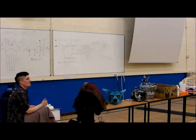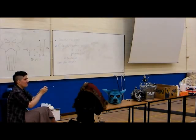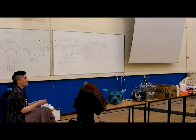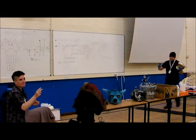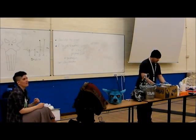The other kind of cure is snap cure. What will happen there is it will be clear, and it will be runny, and then suddenly you will see a white spot and it will spread in about 10 seconds to cover the entire mould. It's quite cool to watch. It's like watching ice crystals fall. It starts from the thickest part of the mould as well. You'll see a little white spot appear and then it will spread in about 5 seconds. You do not want to use that for rotocasting.